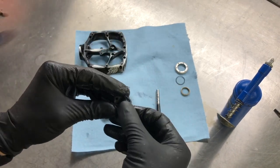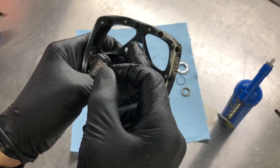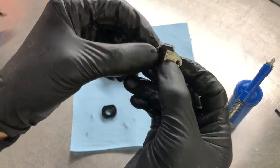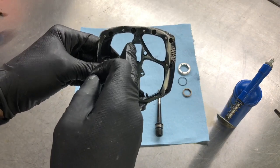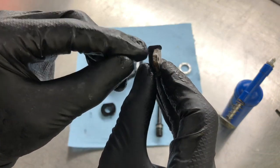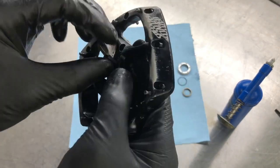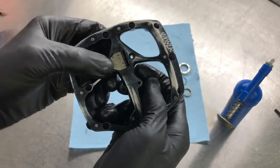Make sure you don't lose that O-ring. I'm going to put this in here — you can see you've got the radiuses here, and you've got to match them up with the radius on the internal part. As you can see on the pedal, you've got these little curves that correspond with the curves on these inserts — there and there. As you want this to go in and turn down, make sure these correspond in line with this. There you go — and that snaps back in place.